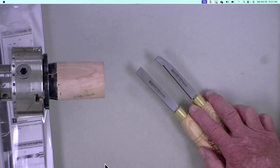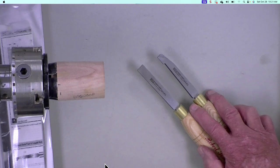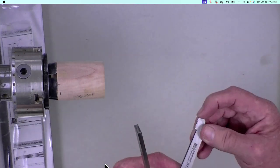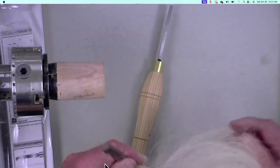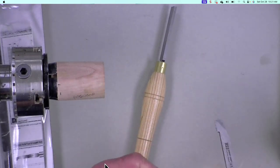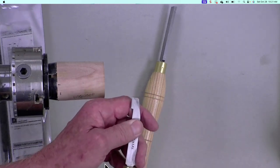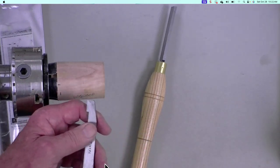The number one thing you have to keep in mind is that lead tooth has to be whole, has to be complete. Take a look at what you're seeing there right now. Is that complete? It's a little nub of about a quarter of a thread there, isn't it? You've got to clean that up before you ever use it. So you've got to take it to the grinder and grind that so at least you have a full lead tooth. Because once you're inside or outside, it doesn't matter, and you have your threads established and a nice rhythm going, and you start rotating this handle around, the lead tooth is going to lead, and it's doing most of the cutting once you've got some of those other threads.